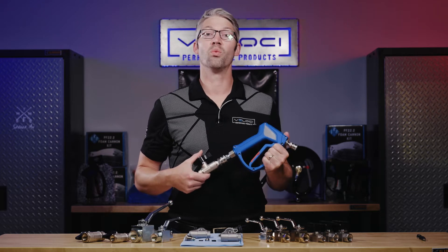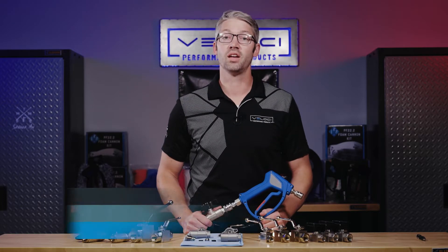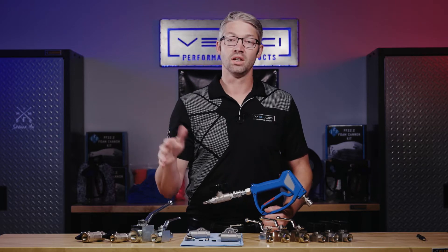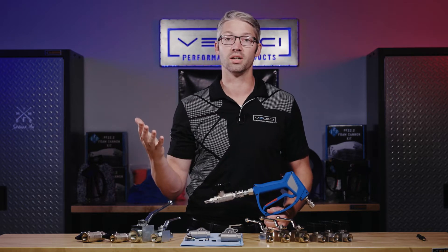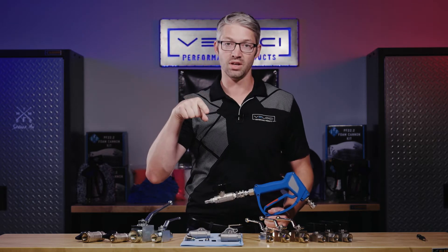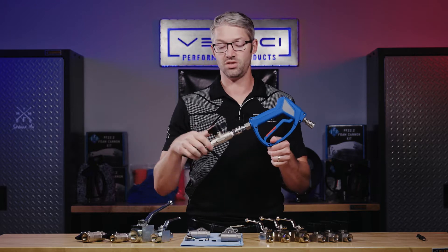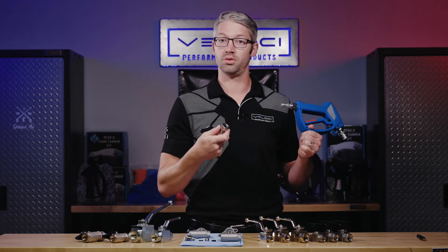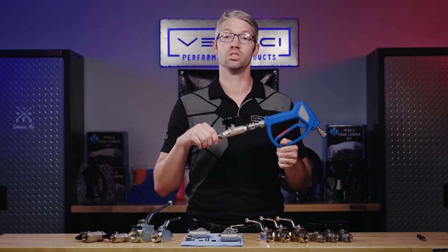Ball valves — why are there so many and which one do I choose for my gun? Some of the most common places you'll find ball valves are on fixed installations where your pressure washer has a plate and you mount your ball valve to that front plate. You can find them in ceiling mounts with pressurized lines in hog barns or poultry barns, with ball valve shutoffs for each drop. The most common place is at the base of a spray gun, used as a shutoff so you can change guns or setups without turning off your pressure washer — reengage and now you're running. It's a huge time saver.